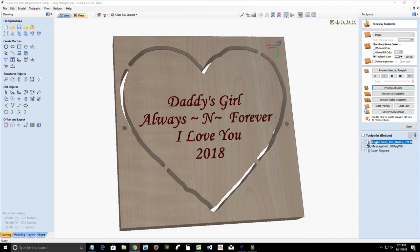Now, the feed rate could vary from material to material because we might be carving in wood like pine, a softwood, or we might be carving in a wood like Purple Heart or walnut, a little more dense. Our feed rate will vary depending on that. I typically have a default feed rate for my end mills of 55 inches a minute, which is a good all-around feed rate for your solid wood, MDF, plywood, acrylics, and everything.